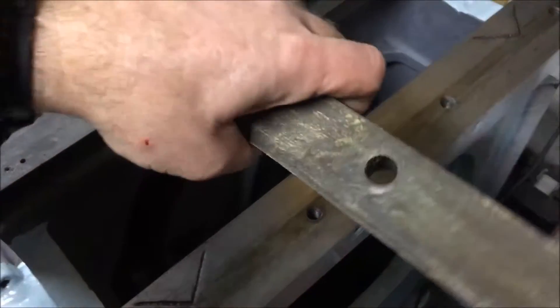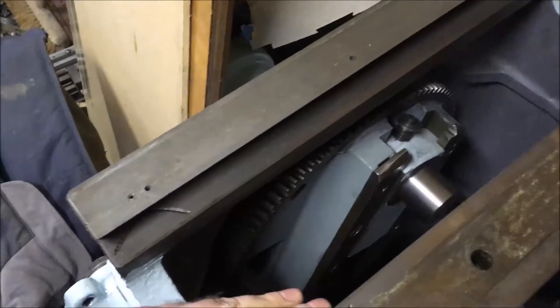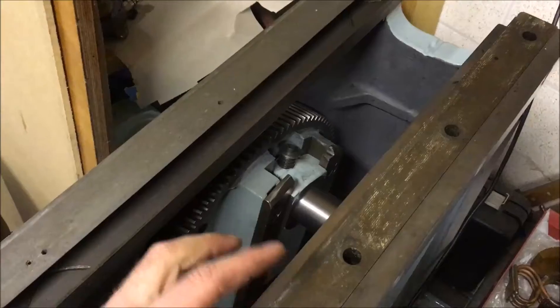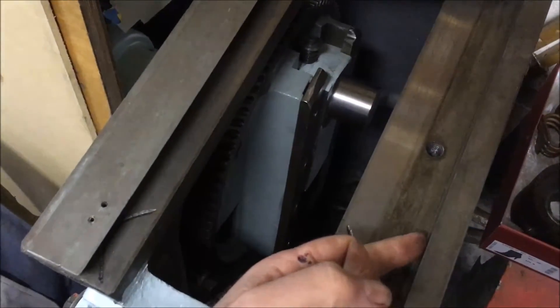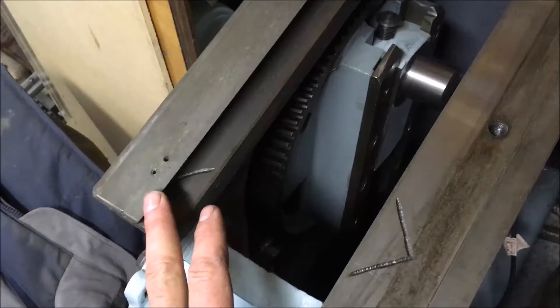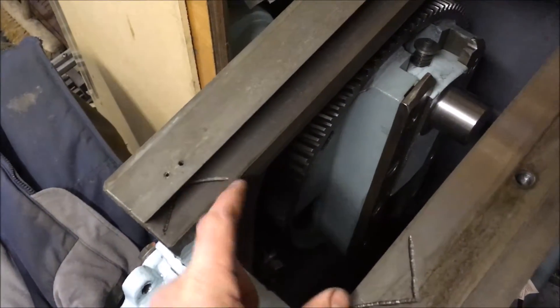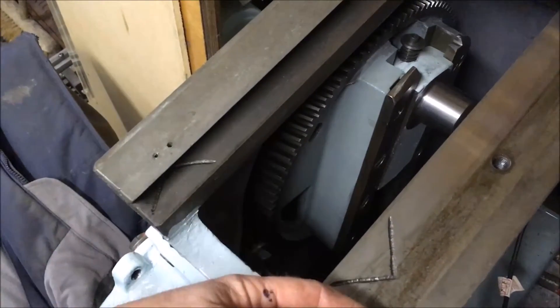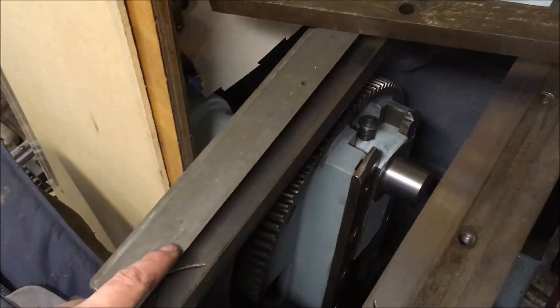It'd be interesting — I've got to do the same exercise on here at some stage, which means another set of modifications, another jig. But I'm not sure whether it's going to give me any great advantage, because this thing would have been jacked, creating all sorts of weird and wonderful shapes. So I think once I've got a flat face on there, the only measurement I can take of any real value is of that original machine face to a known position on there. So I might make up a little jig to hold a DTI, plunge a dial at a given height and of a fixed length, and just run it along the length. The only downside is I know that face is going to be worn, so it's going to have to run off that.